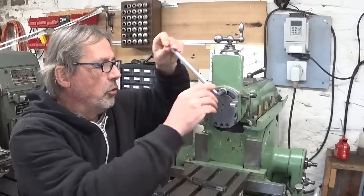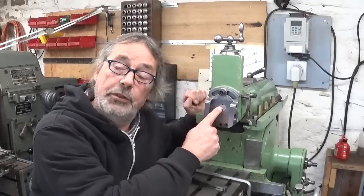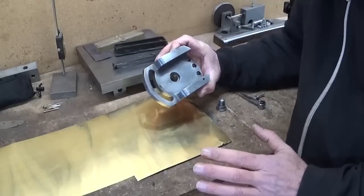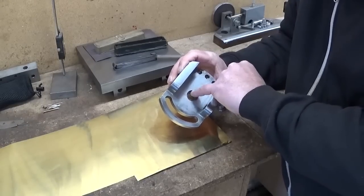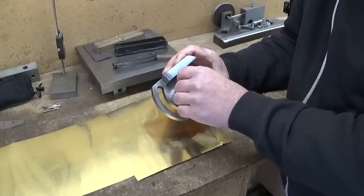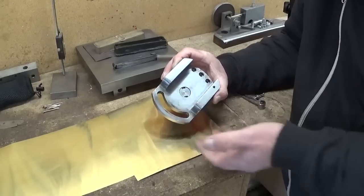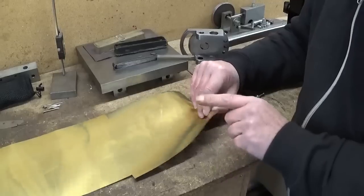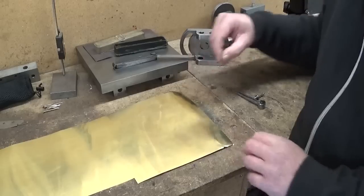The only thing I have to do now is figure something out to tighten this center bolt here, because now of course there is a little bit more wobble. Maybe I can make a little washer that fits in here and around my bolt, so the bolt will sit one-tenth of a millimeter higher than it is now. And I have here some brass material — this is one-tenth of a millimeter thickness. Let's see if it works.